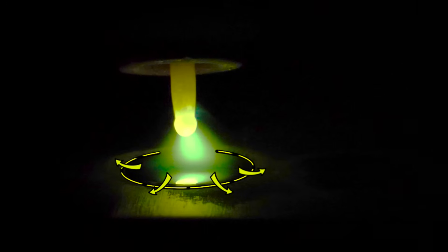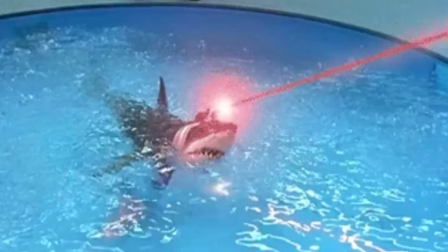Gas level is very important in relation to the cup size you're using. If you're running too much gas, you'll notice the edges of your puddle being blown around and becoming turbulent — especially going around corners, the puddle can become unstable. Excessive gas can also cause your arc to lose its focus, especially on thin material. We want our arc laser-focused — like a shark with a laser beam on its head. That's the type of focus you want with your arc if you want to be good at TIG welding.